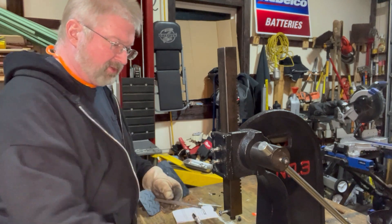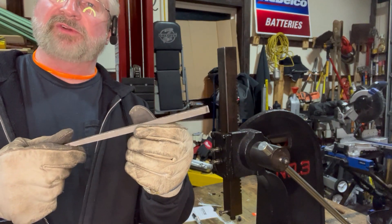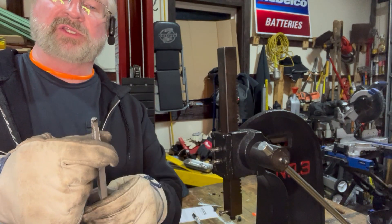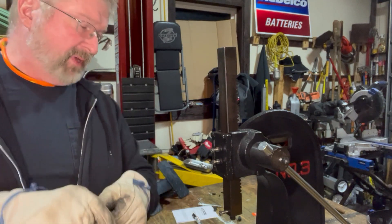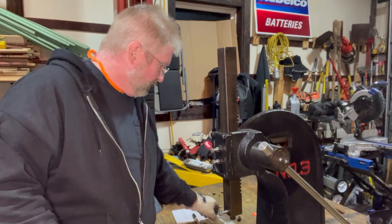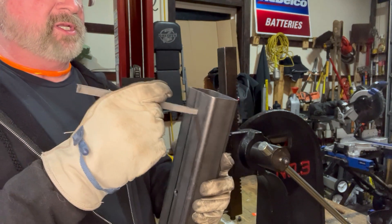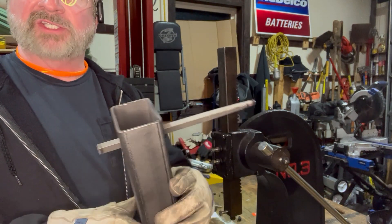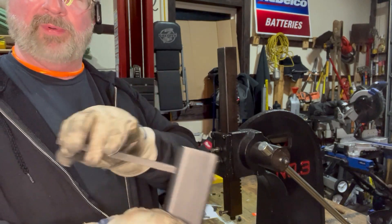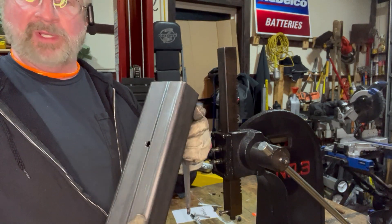The process I used was that I basically had a three-eighths of an inch file that I sawed the handle part off of, and the tip is getting kind of reamed out from me basically pounding on it. This square hole is obviously complete and done — the file passes through very easily. I'll just have to file and clean up a little bit. This side is still round and this side is becoming a square.